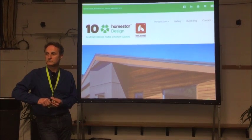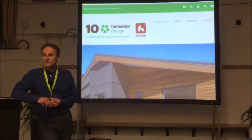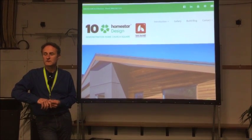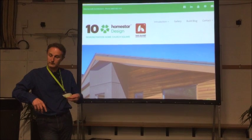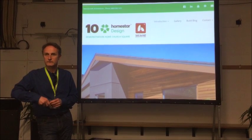We've got PVC windows. PVC isn't a particularly environmentally friendly material, but when you look at it in context with what it's doing for you, it is. It's a bit like concrete — concrete is a pretty nasty material, it uses lots of energy, but if you've got thermal mass in your building it'll really pay off over time. The amount of energy you use through the life of the building is many times over what you'll use in producing the concrete.